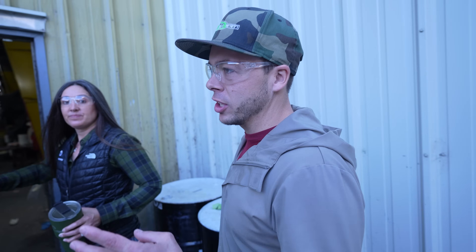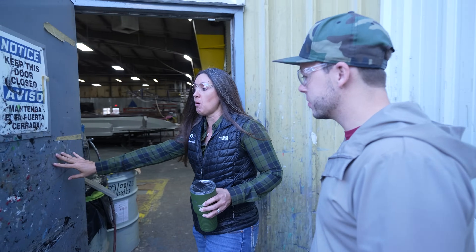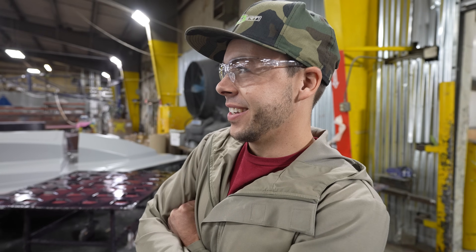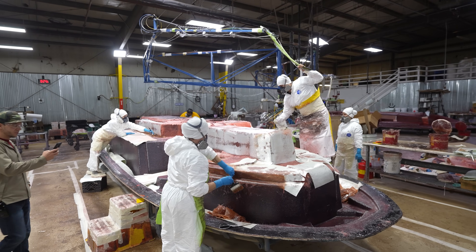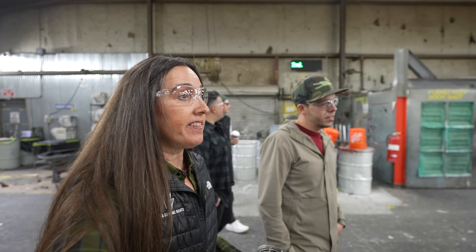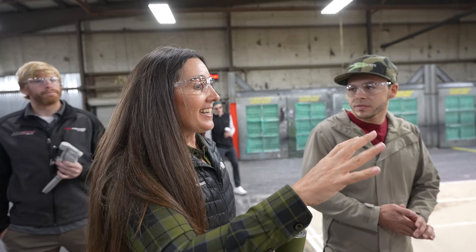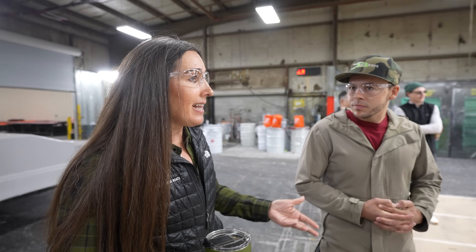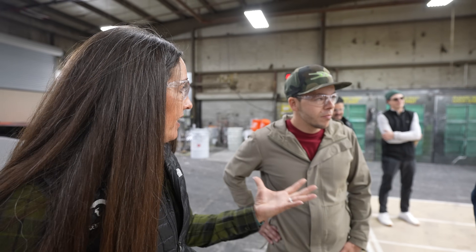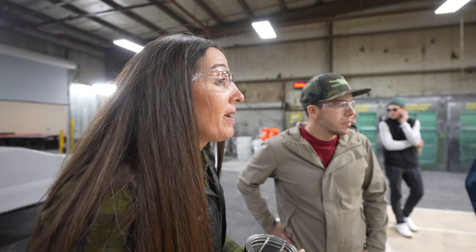This is building number two — lamination. This is where we add the structural fiberglass to the boat. Up to this point we've only sprayed color into a mold. They've already done what we call the skin coat — chopped fiberglass mixed with resin that they spray on and roll out into every crevice and corner very consistently. We call it the perfect coat because it allows the gel coat to shine more consistently. We do both chop and hand-laid fiberglass because each has a specific purpose.